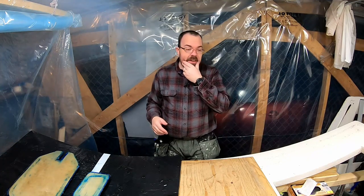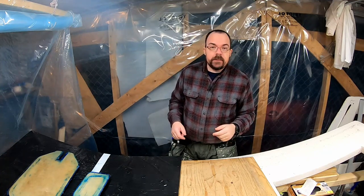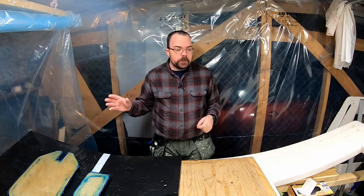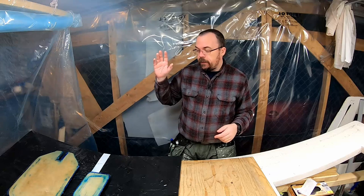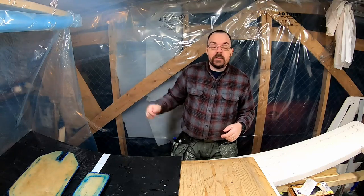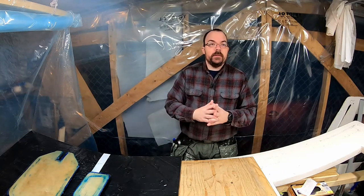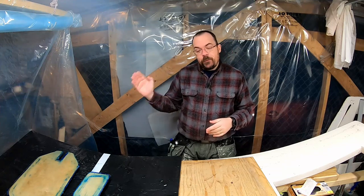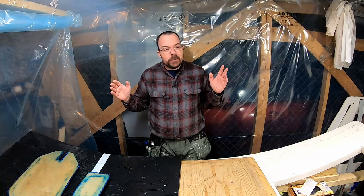So just a final fast update. It's laminated right now. It's gonna cure tomorrow, and then I'll come back in here and sand it, and trim off the edges, and then put a new layer or two on the edges. For right now, I'm gonna want to get out of here pretty fast because the smell is just awful and gets to my head directly. So I'm gonna cut the movie here.